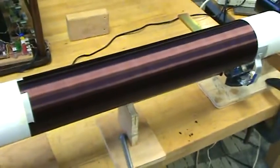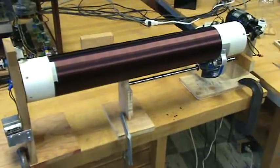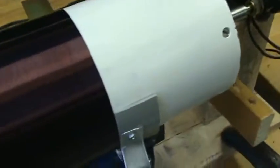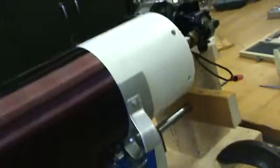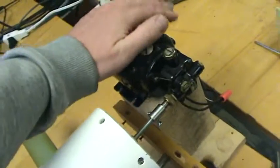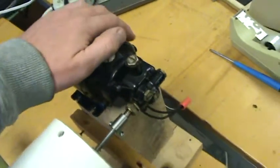The wire itself is three quarters of a kilometer long, wound for a quarter wavelength frequency of 100,000 Hz. This thing worked very well - there is not a single imperfection anywhere on this wire, not a single gap or crossover. I had to watch the counter just to make sure it was working, but that's no big deal. You can see it's been pushing up against the pipe just fine. The motor itself is really quite warm - it's probably operating at the limit of its mechanical load, rated for only 1/70th of a horsepower.